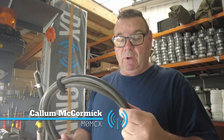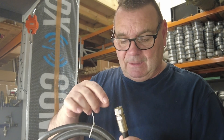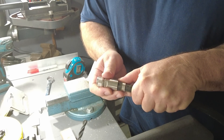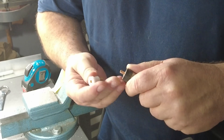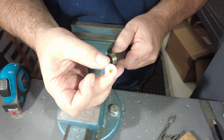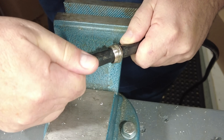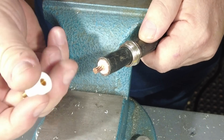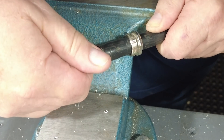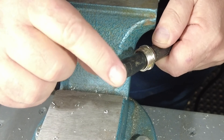This is a really quite heavy coax called Ecoflex 15. I need to salvage off the end one of these connectors, apart from all the other paraphernalia. This little piece here has to go over — it's just a push fit. And I remember when you cut this it's got to be pretty accurate to get that into there, because if you just take the snips to it you end up with edges and stuff, so I seem to remember I used a file here.